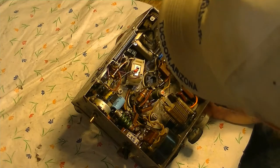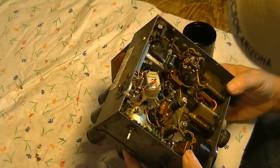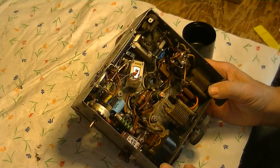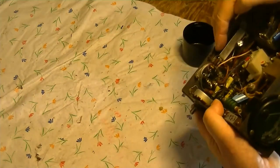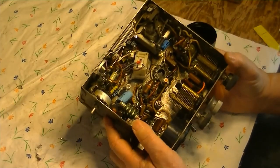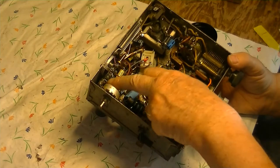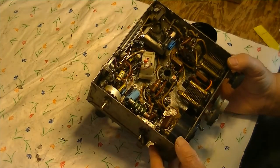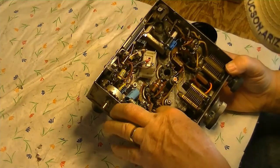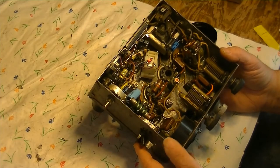This Collins-type mic jack is typical military surplus. The can-dome multi-section resistor in the back is typical of what you'd find in a small console entertainment radio like a Zenith. I've put in some new modern Allen Bradley resistors where old ones had wandered off spec. The whole point being that everything was scrounged.